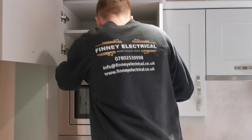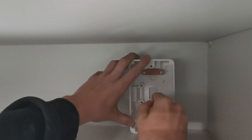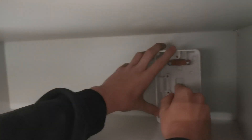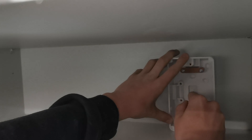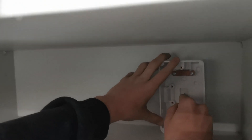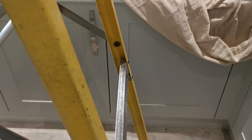We're going to move on to powering up the appliances. We'll get the box in the back there, mark it out, and use a hole saw to drill it. You'll have two 6mm cables coming through for the oven. To the left will be a double socket with a hole just underneath for the plug tops, and 2.5mm cables coming into the socket. There's also a socket to go in the back for the gas hob and extractor fan, and a socket down below for the dishwasher and fridge.